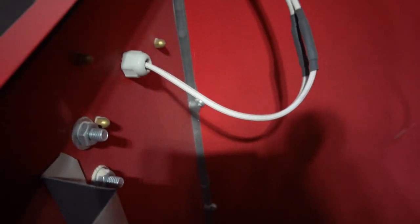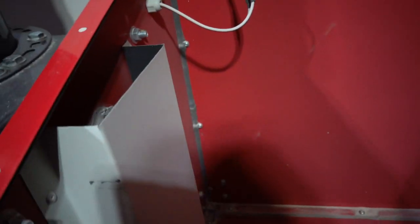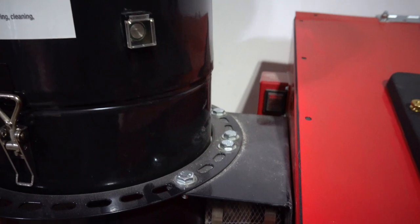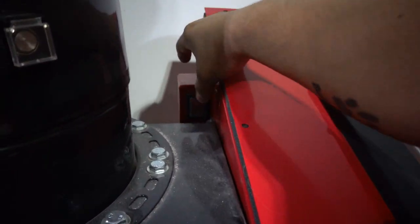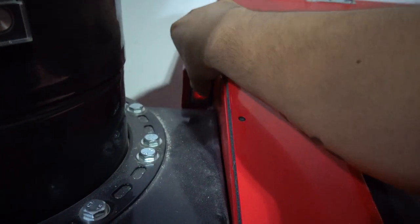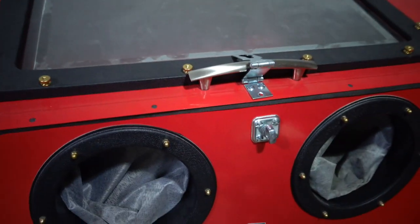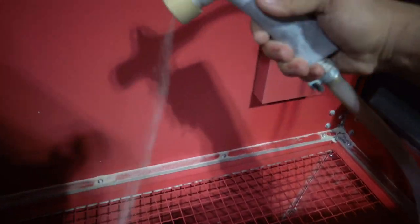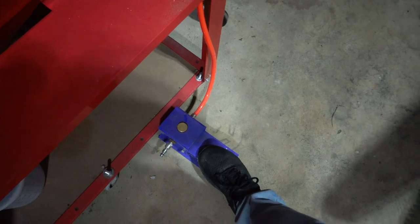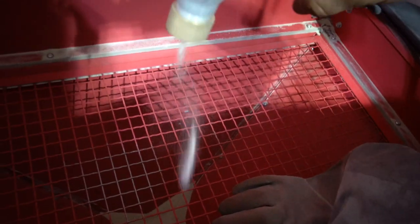I wanted to use the factory switch, so I made sure everything was working. For the vacuum, I turn it on right here and we're good to go. Basically when I want to sandblast, I turn this on for the lights, turn the vacuum on, and then hook up my air down here. With the Eastwood foot pedal, I don't have to pull the trigger — I just press on it and it starts sandblasting.